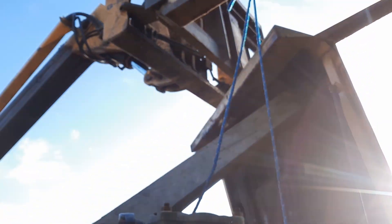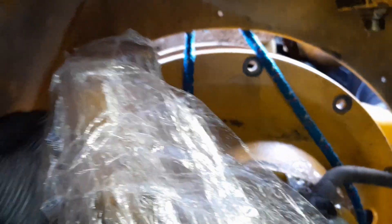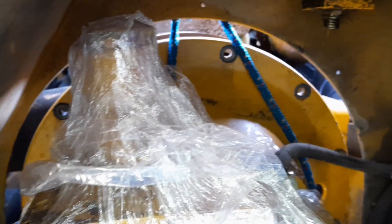I'm just keeping this black timber under the back of it. There she is, rigged to the loader. I have to be very careful doing this to make sure I don't damage the insert in the flywheel that the pump marries up with — making sure that as I'm lifting, it's not pulling the pump against the back of the engine when it isn't lined up. I'm going to level out the back of the pump, then go topside and see can I rotate the pump to line up with the insert, then give her another little lift and see can we pull her in.